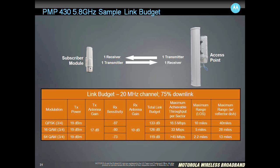One thing I didn't mention yet is you can increase the gain of the antenna on the subscriber by adding a lens, which you may be familiar with from PMP100 products, which basically is a polycarbonate antenna that slides over the top of the module, and that gives you about a 6 dB adder to your gain.